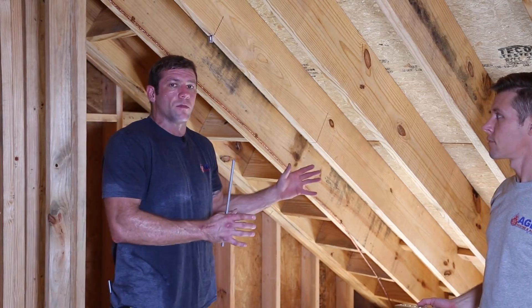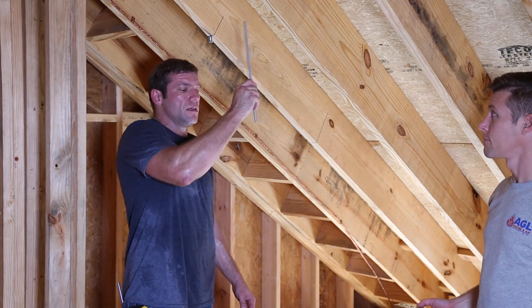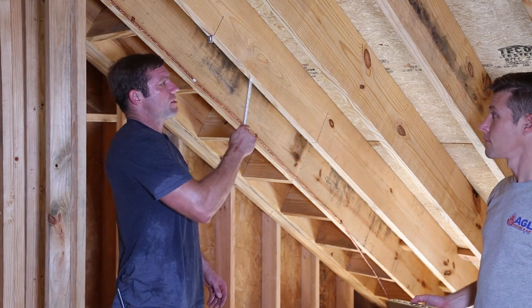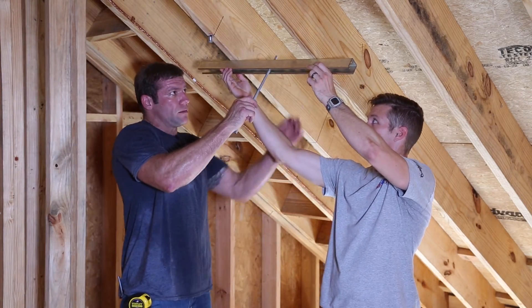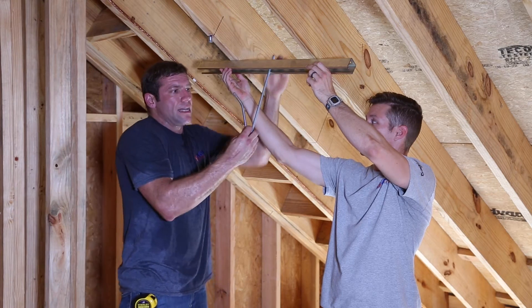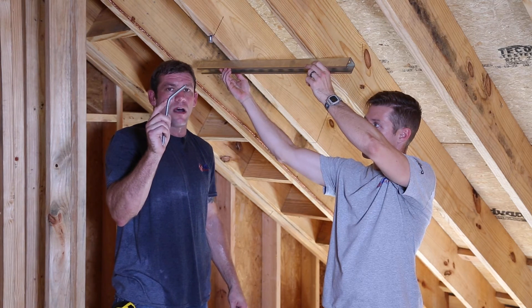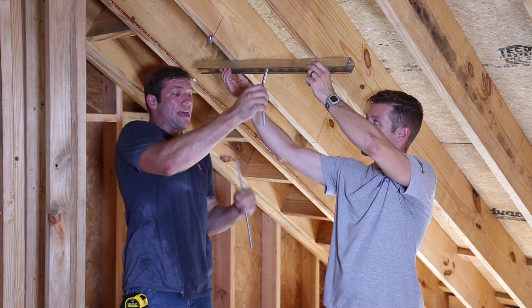Let's say that the way my platform lays out, I actually want to have a point right here. One error I often see is that somebody will lag a piece of unistrut right to this joist, put a rod through it, and then put a bend in the rod — because as you see here, it doesn't hang down naturally. They actually take and bend their rod. Well, this causes two problems: one, you've affected the strength of this rod, and two, you don't know exactly where that point is — it's actually off a little bit. So at the end your rods are going to kind of bow out.